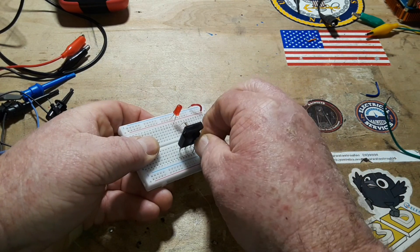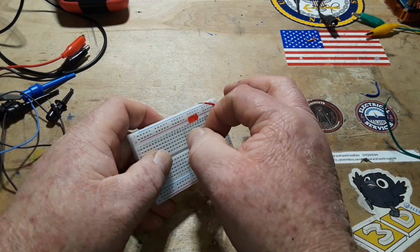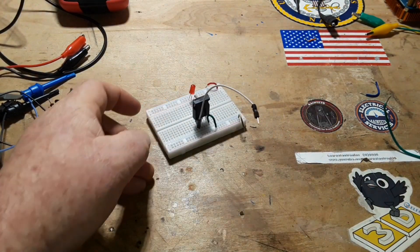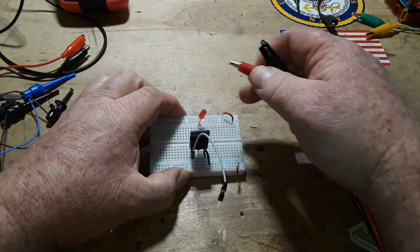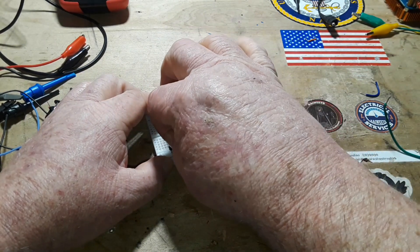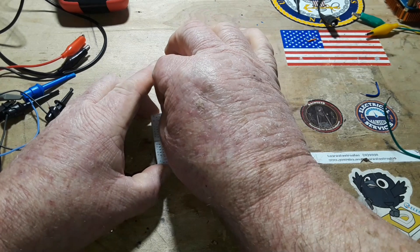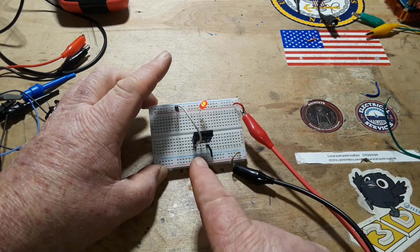Source to ground. We need a wire to control the gate and give it some power — this is 12 volts from the power supply. We'll start with the gate at zero potential. Circuit is energized — we have nothing, which is what we expect.